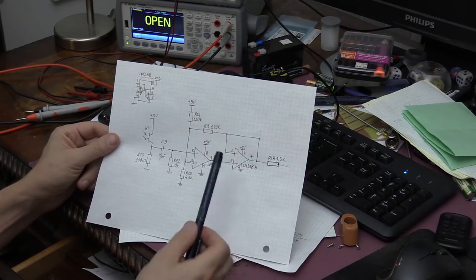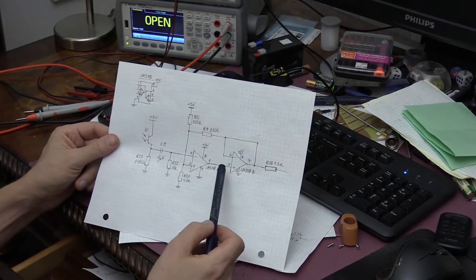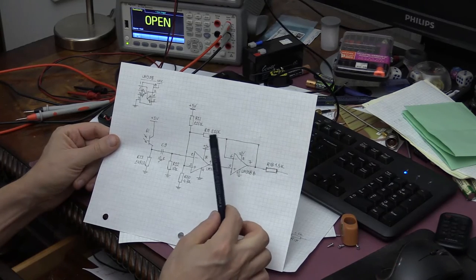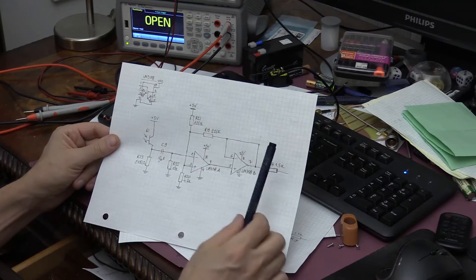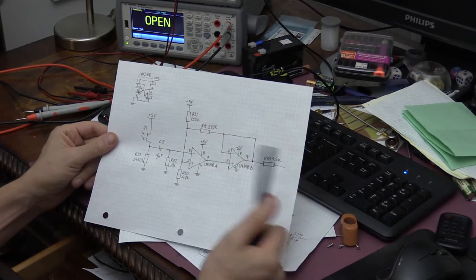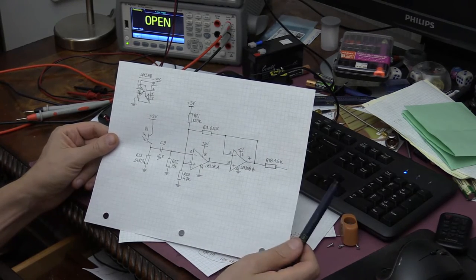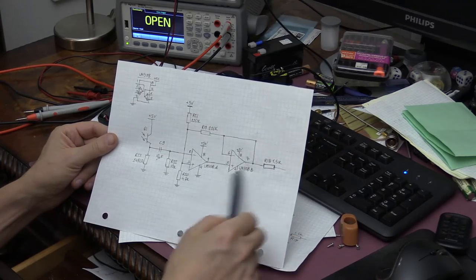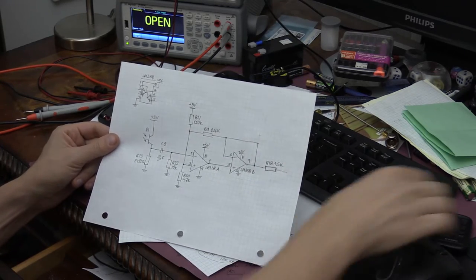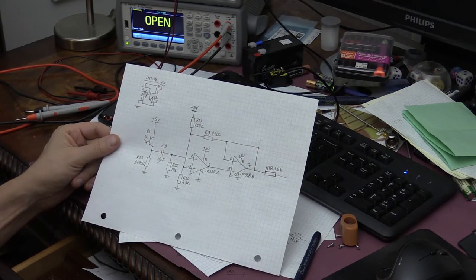I think it is. The only surprise I got from here is that this second part of the operational amplifier is simply used as a buffer, and I don't see a reason why. My understanding is that if both parts are used to split the amplification, the operational amplifier would have a much higher bandwidth. But I'm not quite sure if that's what they were looking for, or they just wired up this second part as a buffer just so that it's used since it's there already. Maybe I'm just not familiar with these circuits very much.